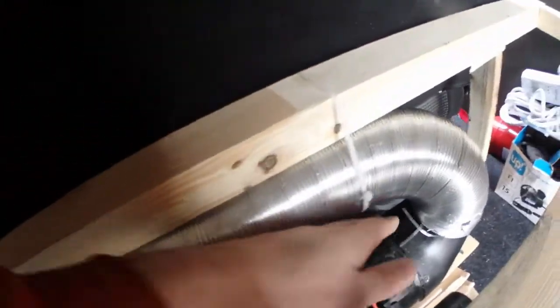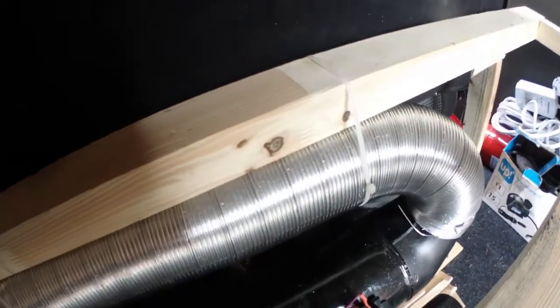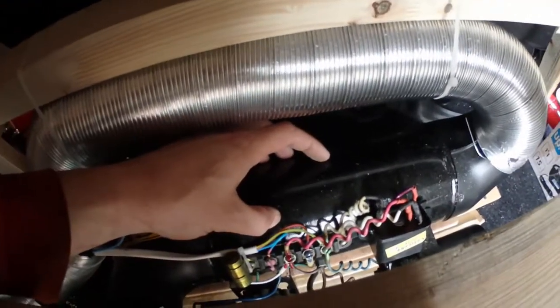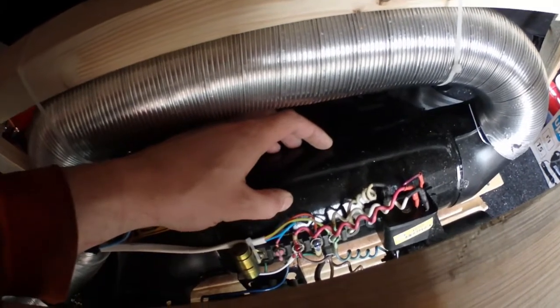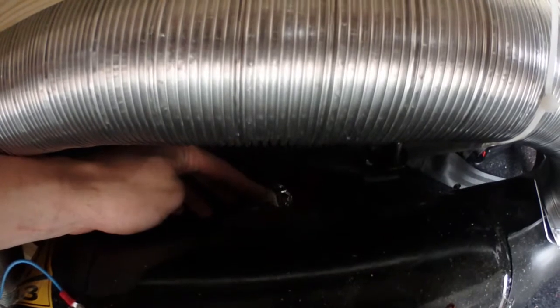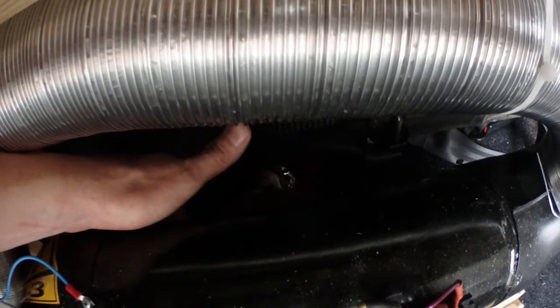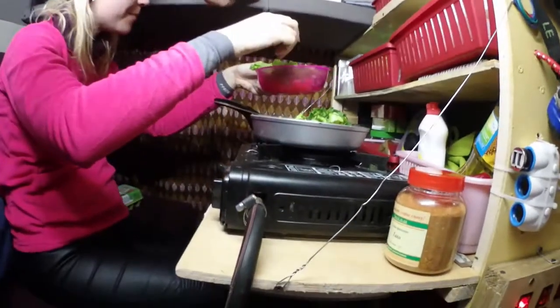You can see this is where the hot air comes out and this is where cold air comes in. Right inside this middle part is a big steel box — it has a combustion chamber in it. If you look really close right here, you can see this is where the combustion chamber exhausts out, and over here right beside it is where it brings in air to burn.